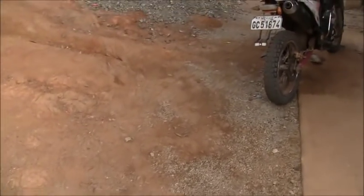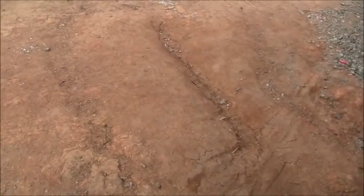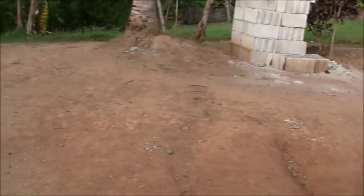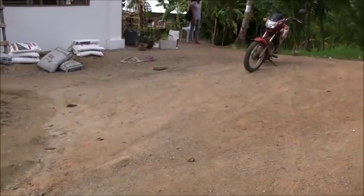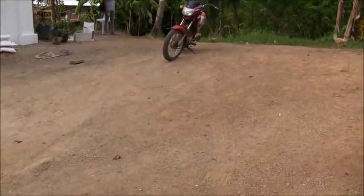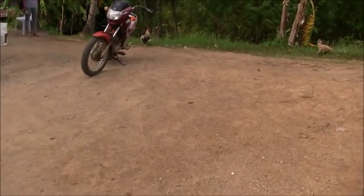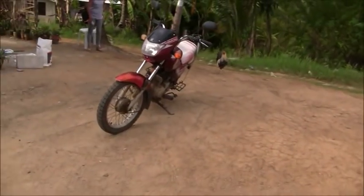I can see that, perhaps a retaining wall here, and then the level there could be taken down just a little, and then all of that spare dirt could be brought over here to level it, and then we'd be looking at a skim coat of concrete. It would have to be fairly substantial because they still get deliveries, and those trucks are 3 to 5 tons. They need to be able to come up here without fear of making a mess of everything.